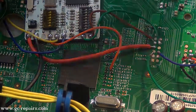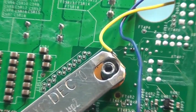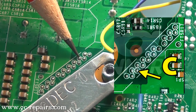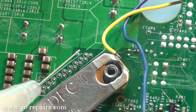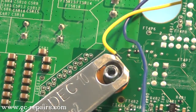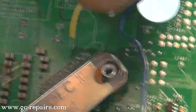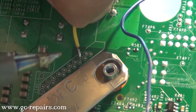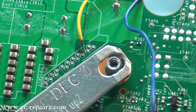Next, the yellow and the blue wire. Simply flip over your board. We'll deal with the yellow first — that's where the yellow one goes, over at this point by your X clamp, it goes in here. Flux it, pre-tin it. Pre-tin your yellow wire. Okay, that's done.